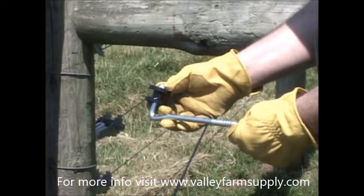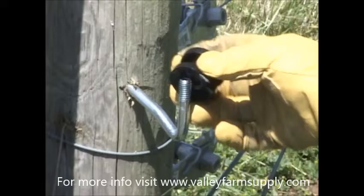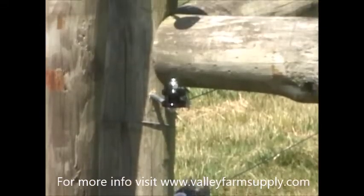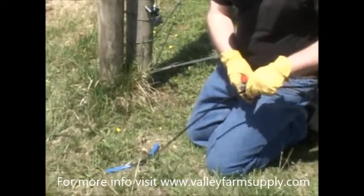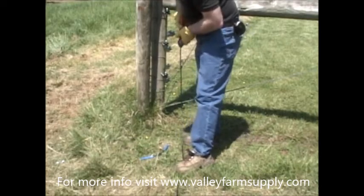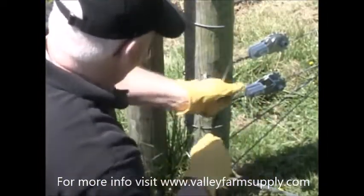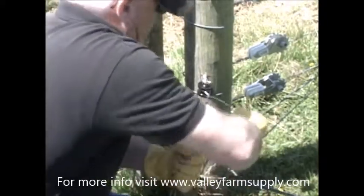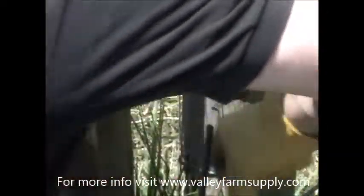Now use the lag bolt insulators on the other end of the fence. First, drill your pilot hole, then screw in the lag bolt, attach the insulator, and tighten the nut. Using a sharp knife or pair of electrical wire strippers, score the fence material just enough to loosen it, but not nick or cut the galvanized wire underneath. The segment should be 12 to 14 inches long. Squeeze with your Gallagher fence pliers, then grasp the outer sheath material with a pair of Gallagher pliers. Step on the wire with your foot and secure it. Rotate the material around the galvanized wire and pull it off. Thread the stripped end of the wire around the insulator twice. Allow a gap of exposed galvanized wire about 3 to 4 inches long to exist between the end of the Equifence — this space will allow for electrical connections to be made. Maintain the relative positions of the wire and insulator while at the same time keeping tension on both items. Make a handle, wrap the wire 5 times, and then break.